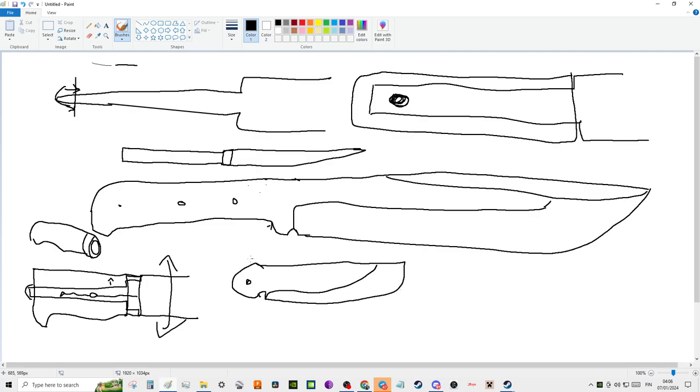They can't necessarily handle sideways movement if you're doing a bend test, because then the scales want to split apart from each other. But it's actually quite interesting how strong folding knives can be. But yeah, when it comes to rat tails, don't automatically think that that's weak or weaker, because often what makes a tang weak is the location of your holes and your pinholes. And what makes the handle weak, especially if you have wood, is pins. So, it's just an interesting thing to bring up.